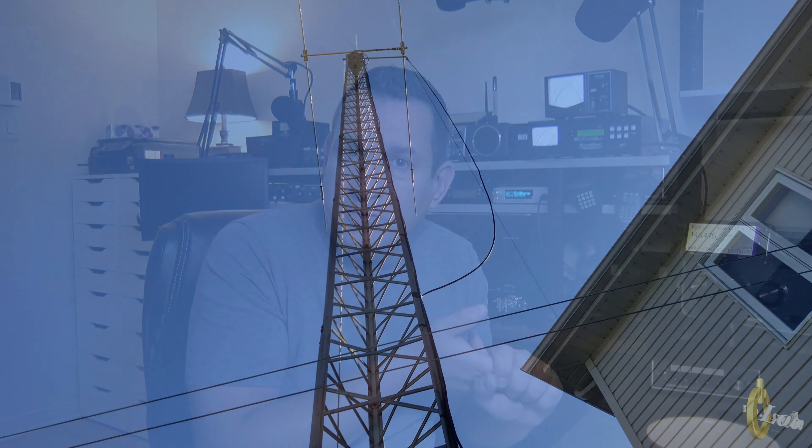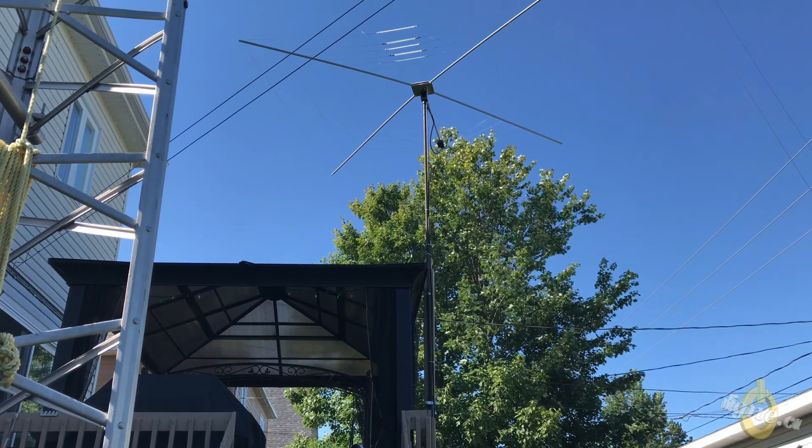This is a remote switch that allows you to have five antennas converged to one. I have two HF antennas right now — a 10, 15, and 20 meter Yagi up the tower, and I've got my 40 meter and 80 meter dipole. I want to add another antenna, which is the cobweb antenna that I reviewed a few weeks ago and want to add permanently. So I'm going to cut at the tower the two HF antenna feeds and use only one coax to get into the shack, and I'll still have two ports to add more HF antennas in the future.